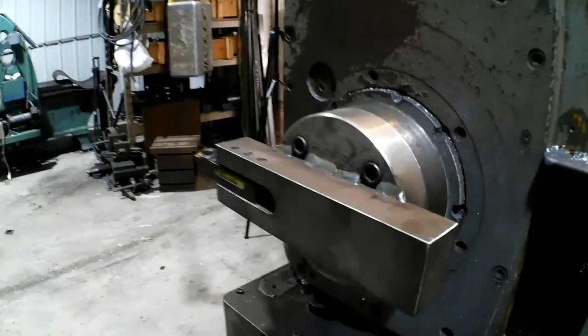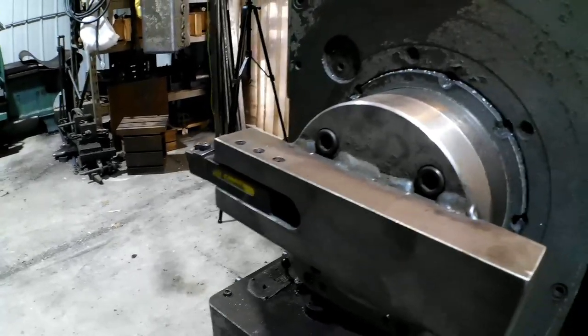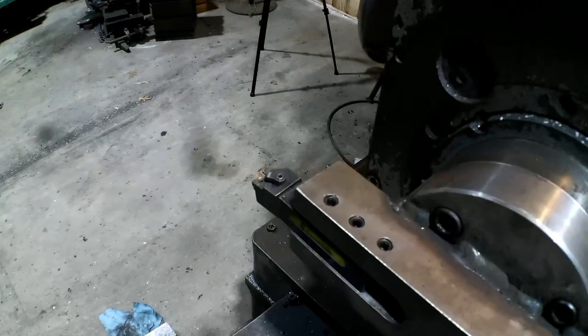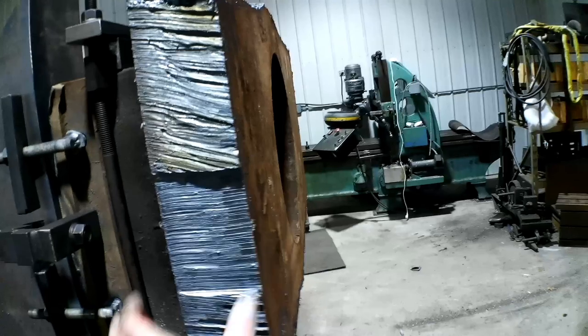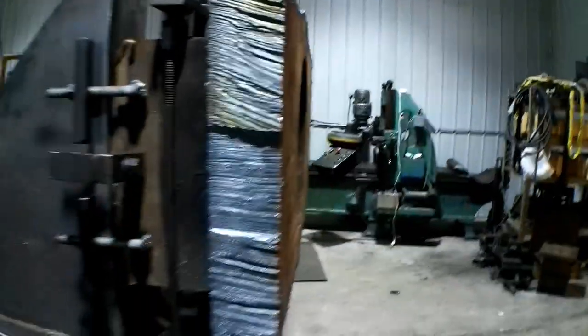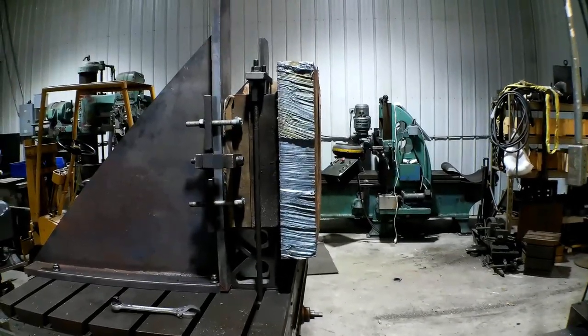And then this is that cutter I use, a fly cutter I made, that uses the opposite corner of the CNMG inserts, that wider angle. You can see that? Now we need to take this thing from the full 4 inches down to 1 inch. So we got 3 inches to cut off this thing. That'll be fun. So let's get going.